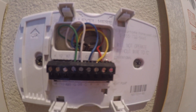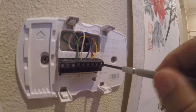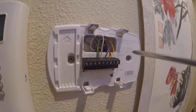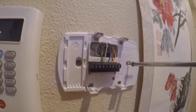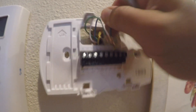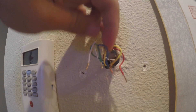We will need to match the same colors to the Google Nest thermostat. Next, you need to take off the wires with a small flat head screwdriver, simply turn counter-clockwise and loosen the wires. Then use a Phillips head screwdriver to take off the thermostat mounting. Now this will expose all the wires. Make sure they are not touching each other — there is electricity running through it.